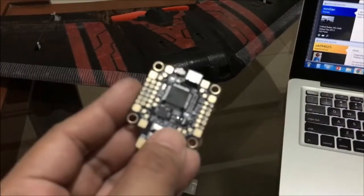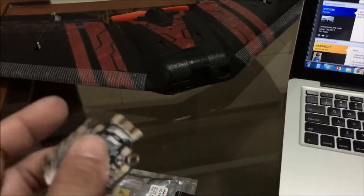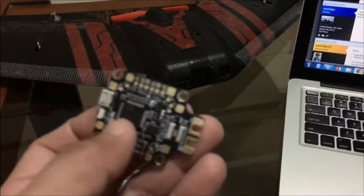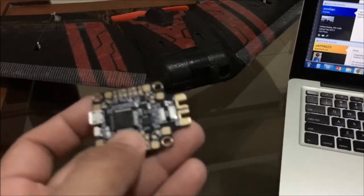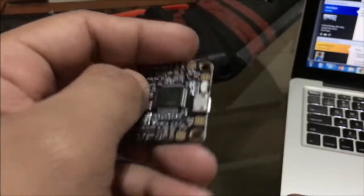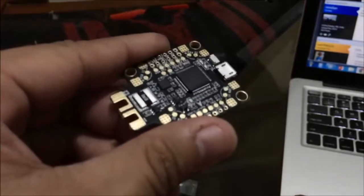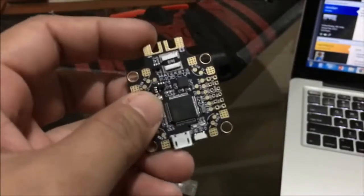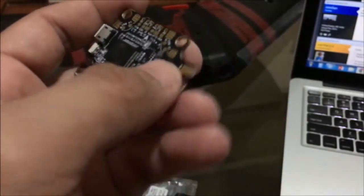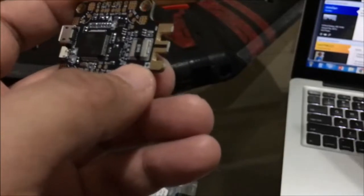Why Arduplane firmware for this Matek board? Mainly because this Arduplane firmware is a matured ecosystem. It has better flight modes, full autonomous mission flights, capable of advanced camera controls, and so on, making the iNav firmware just a portion of the stuff that you can do with the Arduplane. And right now, since Arduplane is compatible with this board, we're taking advantage of the Ardupilot ecosystem, which was popular on APM boards, or Ardupilot Mega boards, as well as on Pixhawk boards.